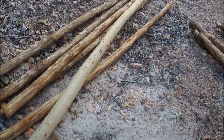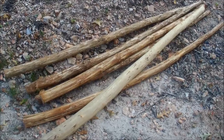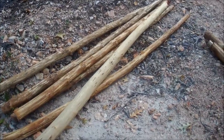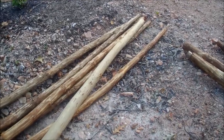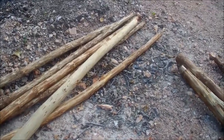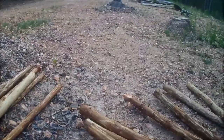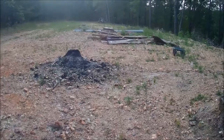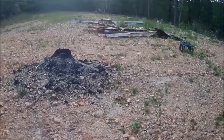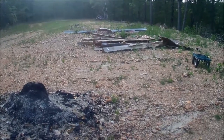And I should have enough of these to make the corner braces. If not, I'll use the 2x4s. The 2x4s are going to be my purlins going in between them, so I can attach the metal roof to that. And I'll get everything moved over here, including myself. Then I'll move the camper down here for the winter, and I'll be in the full sun for the winter time.